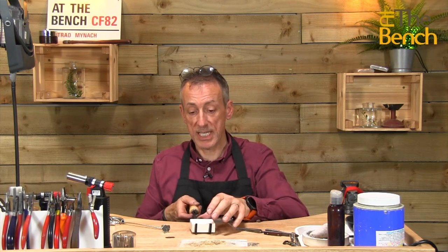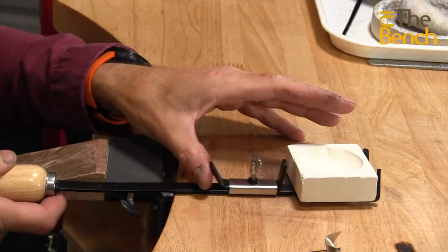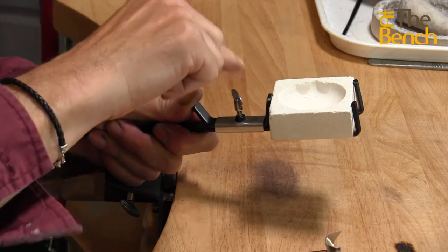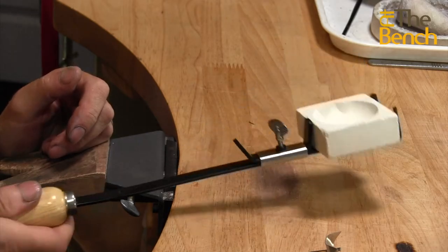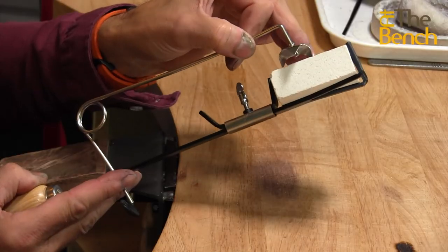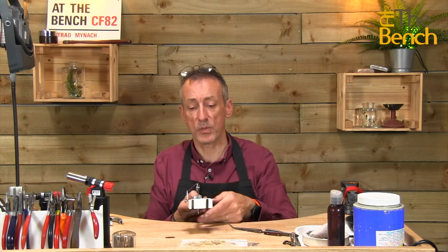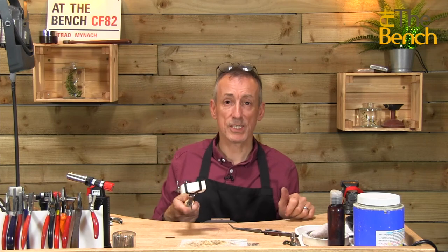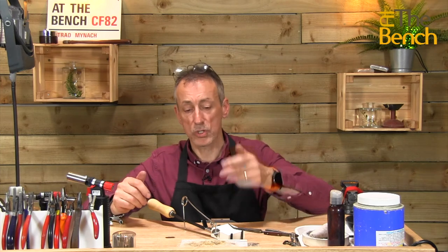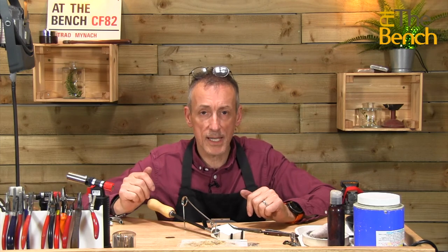If you're unsure, it's always better to be sure: keep this pushed forward. If it's pointing upwards, bend it forward slightly and that will really help hold onto the crucible. Push with your thumb whilst turning the wing nut and for me that holds it nicely in position. If you're still unsure, simply push this into the first hole and bring that claw up with just a slight bit of pressure - don't put too much that it forces the crucible up the opposite way. That is how to assemble your crucible holder and ensure your crucible doesn't fall out when you're melting. My name is Andrew Berry for At The Bench - thank you for watching, take care, see you next time.